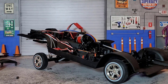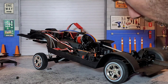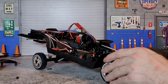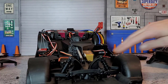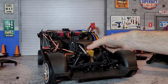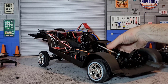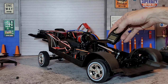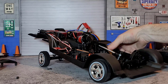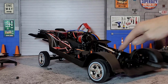And make sure we're okay over here. All right, and we're good. Now notice the servo is silent. So now what should be happening is the temperature should be coming down on the servo. While it was forcing there and I was doing the adjustment, it heated up that servo. But we want to make sure that this sucker goes back down. So we're already actually starting to lose some heat at 103. What we're gonna do is move over to this servo here, and we're gonna come back and check to see what that temperature is.